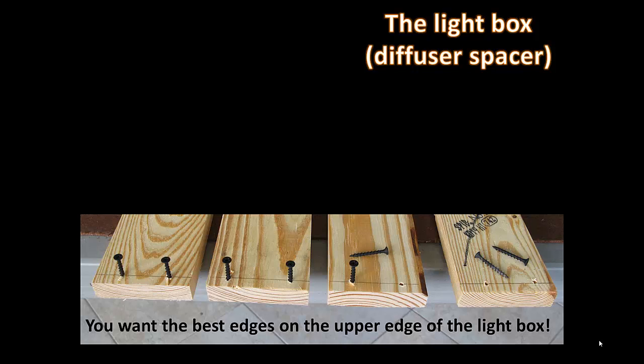This will ensure that the tip of the screw will not walk away from the position as you drive it in. This is caused by the variations of soft to hard grain in the boards. It's unavoidable. Or you can skip the second use of the drill bit. In other words, just drill the pilot holes, pre-insert the screws as shown here into the pilot holes, and drive them in until at least 1/8 inch of sharp point protrudes out the other side of the hole.